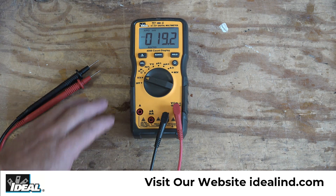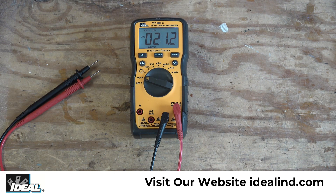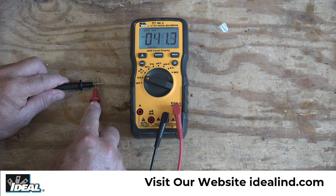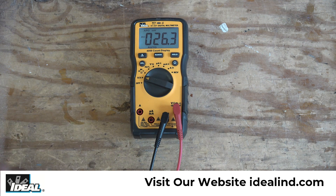The tester is giving us a reading — it's AC voltage reading millivolts. These testers are capable of measuring down to a thousandth of a volt, and you'll see a fluctuation on the display. Nothing's wrong with the tester — it has to do with the resolution of the tester and the test leads essentially acting like small antennas, picking up radiated electrical energy from sources like wiring in the walls and power cords. If you touch the test leads together the meter zeros out, and if you actually take measurements that will go away as well.